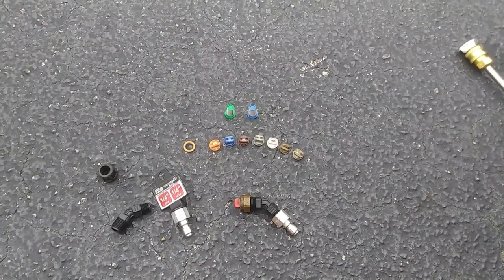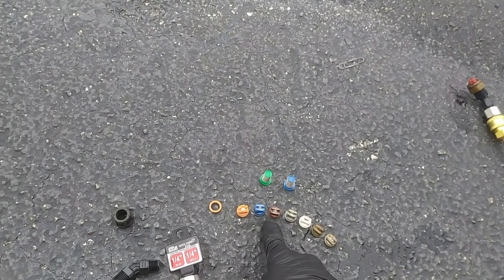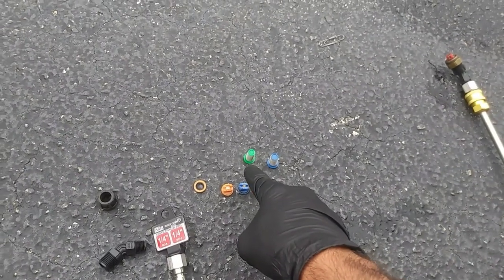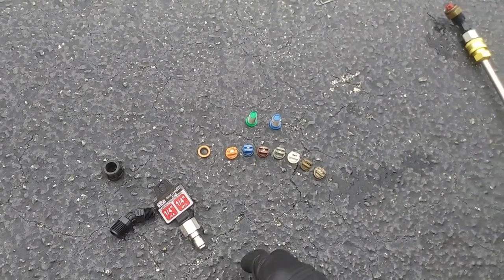Let me show you the difference: you get an angled spray and look at the difference in size — the area you cover is literally twice as much, so you can move a lot faster when doing lawns, perimeter, or anything. You can also decide how much volume depending on the tips, whether you get a 1.5, 2, 3, 4, 5, or 6 gallon per minute. There are also brass ones, and you have two different filter options: 50 mesh and 100 mesh, depending on the filtration you need.